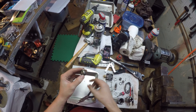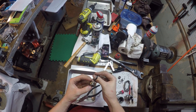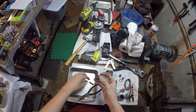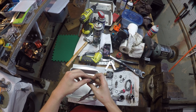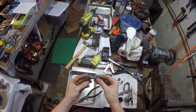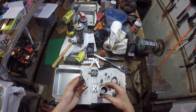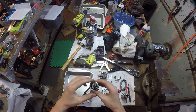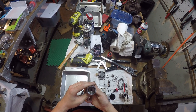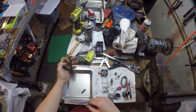Now assemble your barrel and plunger — put your check ball in there, put your snap ring on there, then the spring. You want to make sure all these parts are lubed up with diesel fuel, or you can use WD-40. I like to use WD-40 — it just doesn't smell as strongly. Then drop it in there.